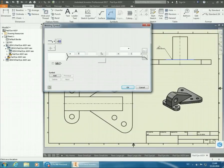We also want it to be welded on both sides, so we can add another symbol on the other side of the weld line here. So we can do weld symbol here, and we want another fillet weld, as these are called. And this one is also going to be A3. So we want symmetry here. We want equal sizes on both sides with the welds.